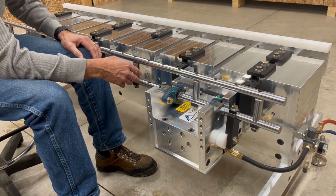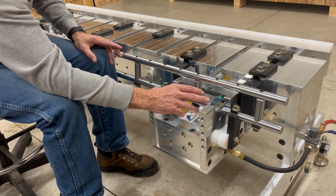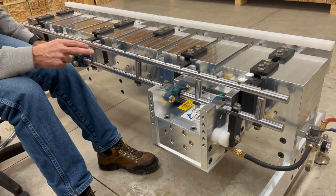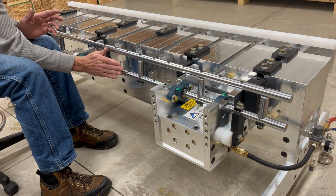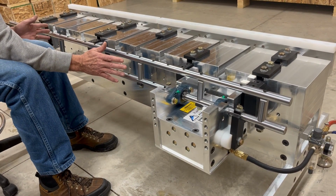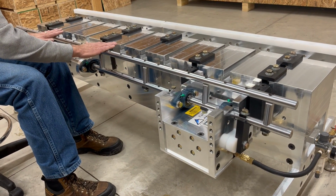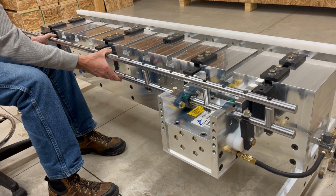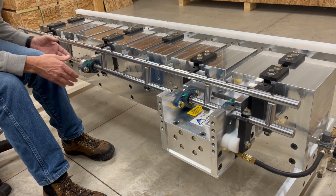We then support and trap the pivot rack assembly between radial flange bearings at various locations, which eliminate any lever force or the effects of lever force outside of the shaker drive. So any force applied on the tray shaft is translated into rotational motion instead of lever force.